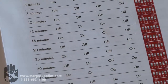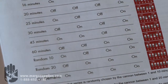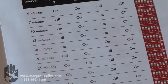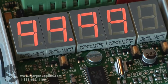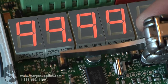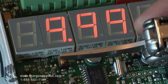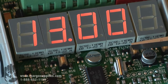Your Zon Electra is capable of firing only during pre-selected times throughout the day, with up to 4 on-off periods in each 24-hour cycle. First, set the current time. Hit the mode button. The digital display should read 9999. Now, set the current time using the hours and minutes button. Remember, the clock is on 24-hour time. 1305 is 1:05 p.m.